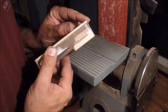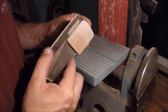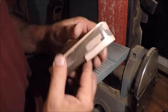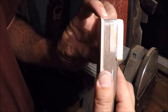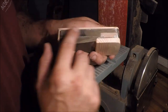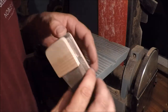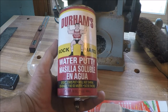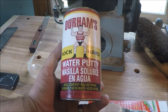We've added at least a sixteenth of material to the front of this, maybe a little bit more. You can see the step here - it drops down to the original casting. All the way around here we're going to have to put some body putty to build this up, and then we'll come back and hit it on the belt sander again. We're going to use Durham's water putty - the proportions are three parts powder to one part water by volume. I just use like a tablespoon or some kind of measure like that.